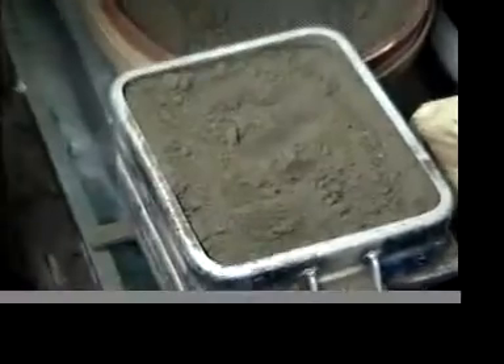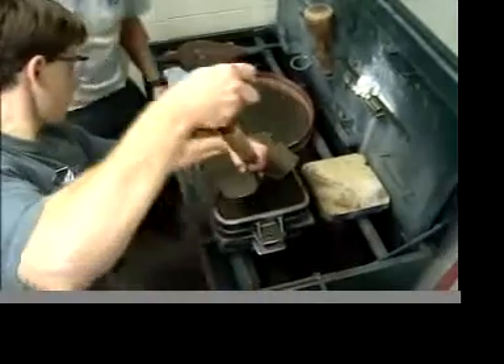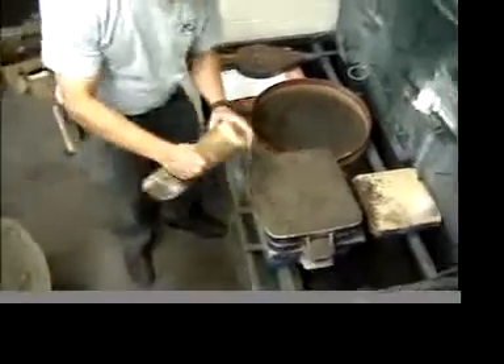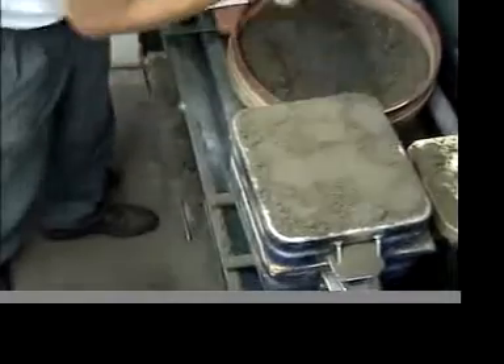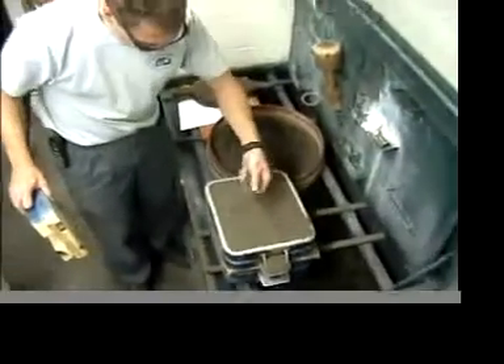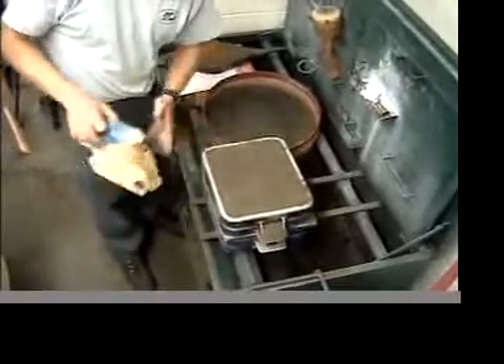Don't leave your hand on the flask like that — if you hit the side of your hand you're going to cut it really bad. Use the flat end again. Sprinkle a little bit of sand on here so that when you put the bottom board on, any low spots are going to be supported by sand.